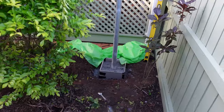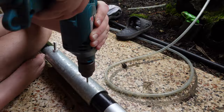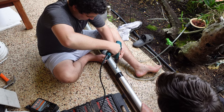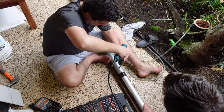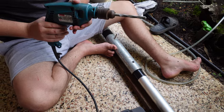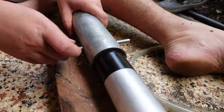This is pretty exciting. This is the footing that I set up over the weekend with my mates. So this is mounting the antenna mast into the 2.4 to 2.8 meter, 60 millimeter diameter galvanized pipe. We just slot it down about a foot — you can see where we've marked on the tape — and then we're running two 10 millimeter diameter bolts directly through in two places for stability. We've also wrapped tape around the mast where we stuck it into the pole to build it up and make sure it's stable.